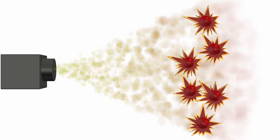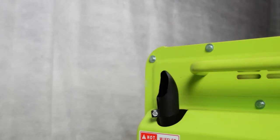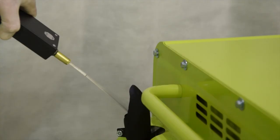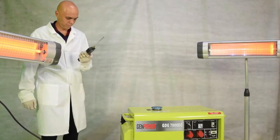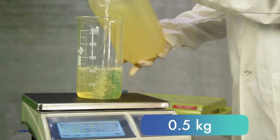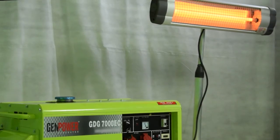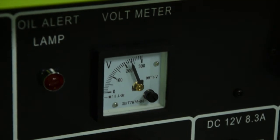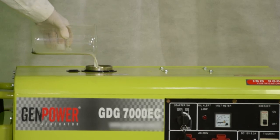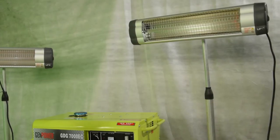Steam also cleans the exhaust system. In this experiment, we tested the fuel with a 5.5 kW diesel generator running at constant RPM. We connected electrical systems to the generator to match its maximum load. We initially filled the generator tank with 0.5 liters of regular diesel fuel and timed the duration of its running, monitoring the voltmeter indications under load, then repeated the run using the emulsion. Running time and voltage were practically the same, leading to the conclusion that the generator running on emulsion with 15% water performs without power loss.